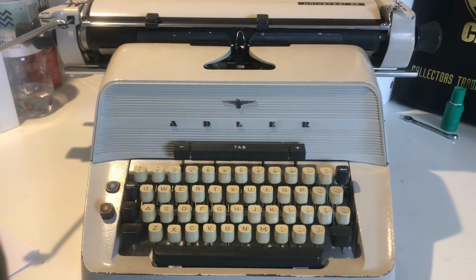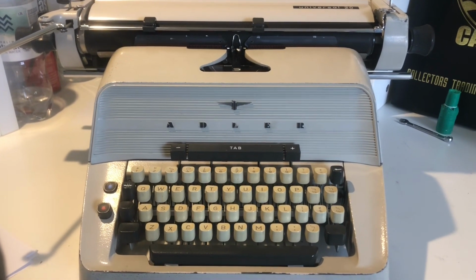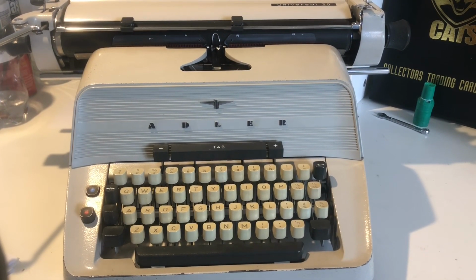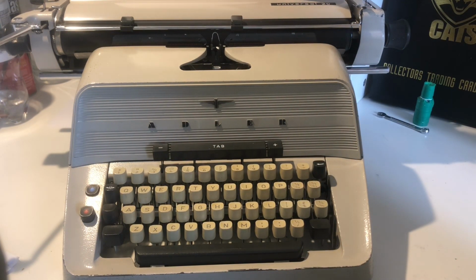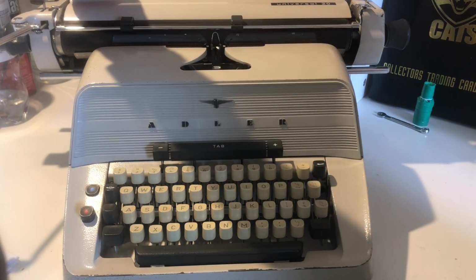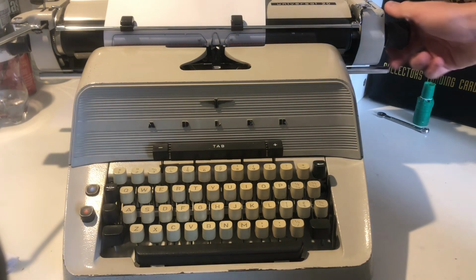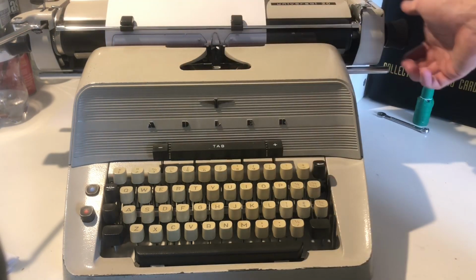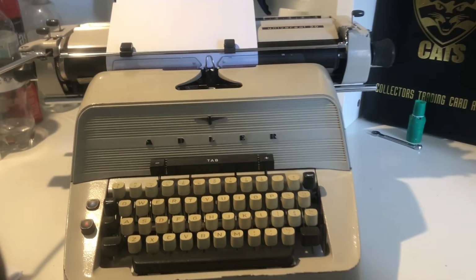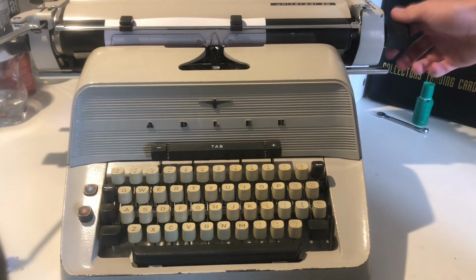At the moment, I thought I'd show you how this machine types. It's pretty simple, just feed the paper in as normal, and you'll see the precision of how this is made. Much like people always talk about with the Hermes 3000, but I don't hear them talk about it as much with typewriters such as this. So you just chuck that paper in the back there. Now this won't probably feed in straight because I'm a bit crooked, but then you can see it feeds straight up under the paper bale. And then you've got your pressure release, as you saw on the right hand side of the carriage. Just flick that forward to release the pressure on the feed rollers. And then, yeah, I'll show you how this machine works.